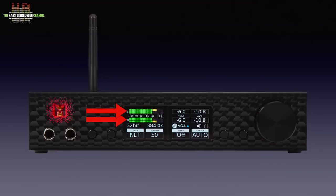The OLED display has two-channel metering for peak and average levels, with numerical representations on the right. Below that are the resolution, sampling rate, MQA indication, and indication of the active output. The lowest line on the display gives you four menu options at a time; using the rotary encoder, other menu options appear. The two buttons on each side of the display correspond with the four menu options. Pressing the most left button changes the left option — here the input is set to network. The rotary encoder becomes the volume control when not used for some time. It's all about the same as on the Brooklyn DAC+.